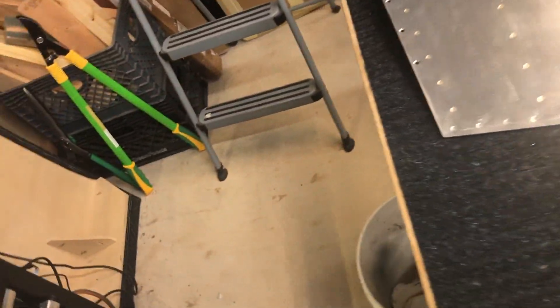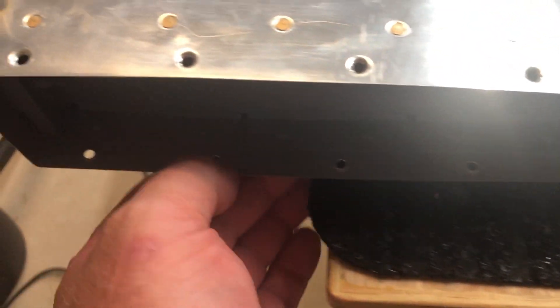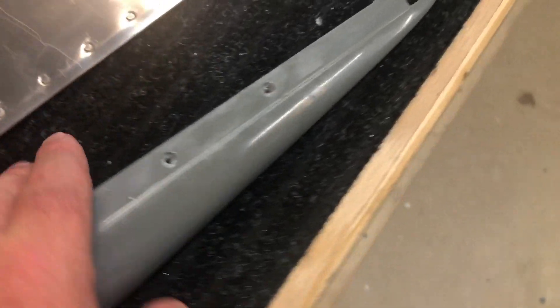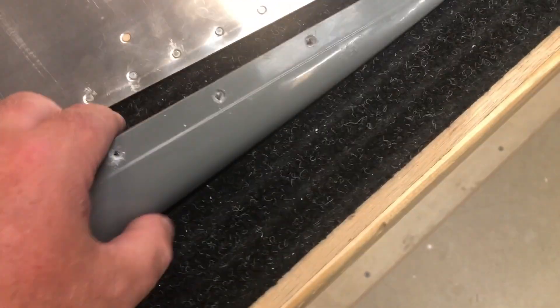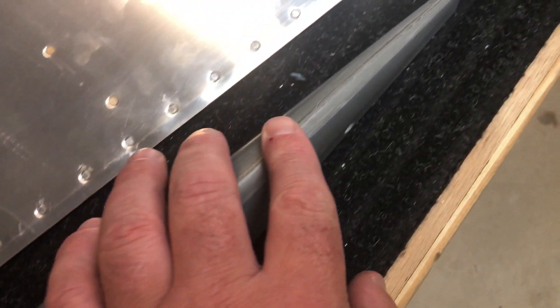Over the last couple days, I've been going very slowly because this is the first one, so I took my time, I measured — there's a half inch gap. It's hard to see that in there, but between this plate and this it's a half inch, so I measured a little bit more than the half inch, and then I sanded this down. I just used a block sander with 80 grit sandpaper, and then smoothed it out with 600. This one I was able to get a nice smooth line.